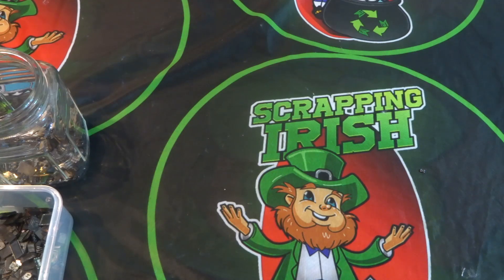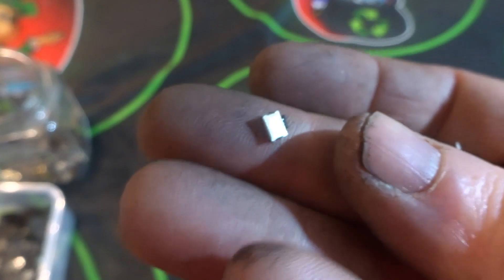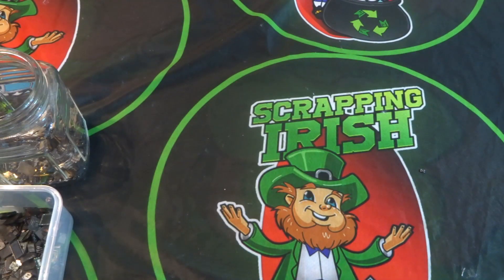I'm having a quick look to see if I can locate a bigger one — there's a lot of other small bits to sift through. There are still little chips and MLCCs to pick out as well. Here's another one — you can see the ceramic base, the little gold rim, and the silver tops. Crystal oscillators, the ceramic versions, are very clearly visible on most mobile phone boards and are removed by heat.